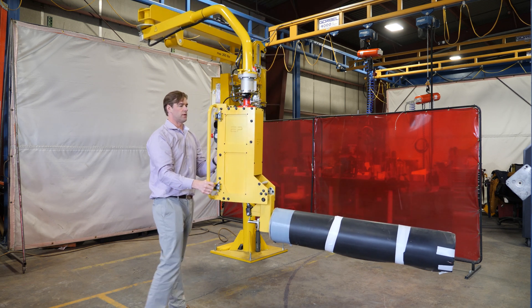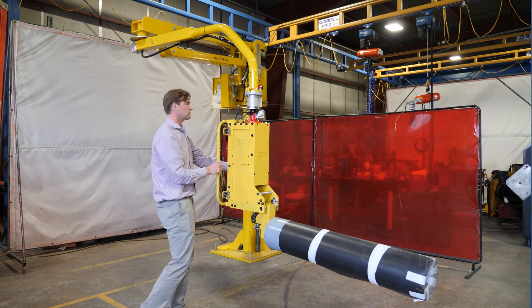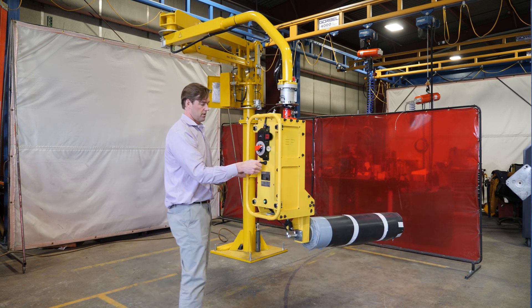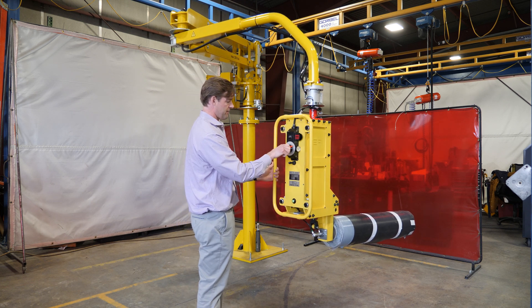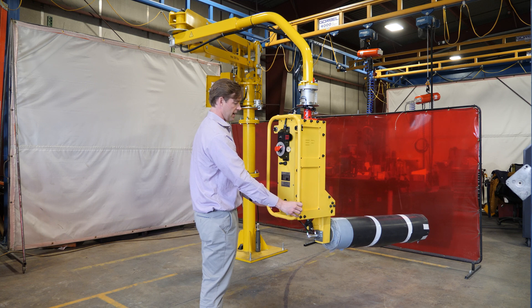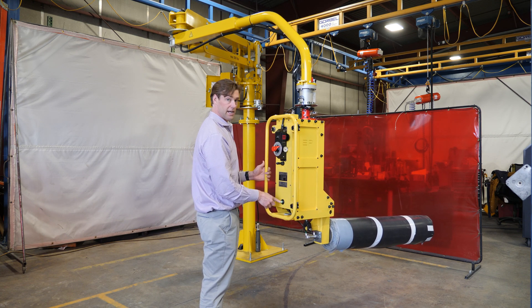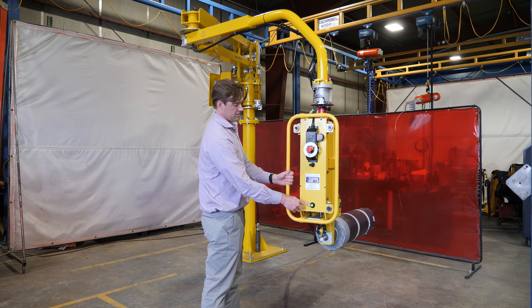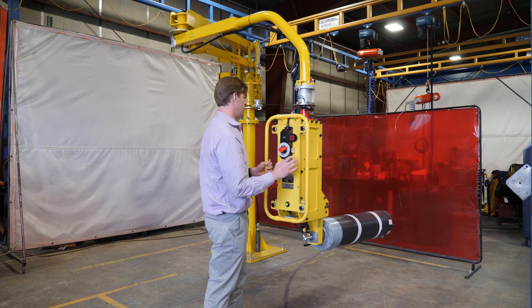This tool is a tool we made for roll handling. You have your pitch function here, you have your load balance here, you have interlocking grip release right here — high and low. The green indicator is on here now so that you can see when the part is gripped. We'll go ahead and pitch it back down.